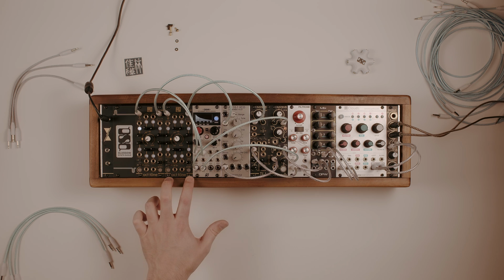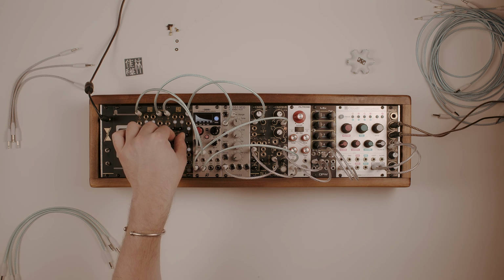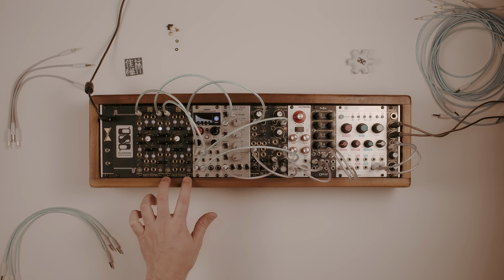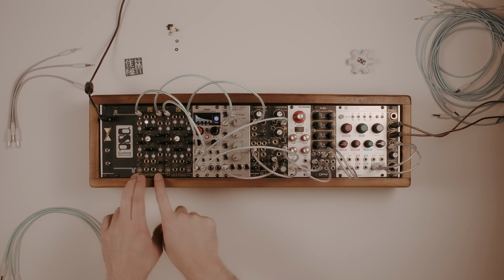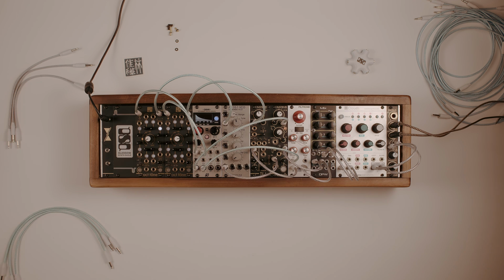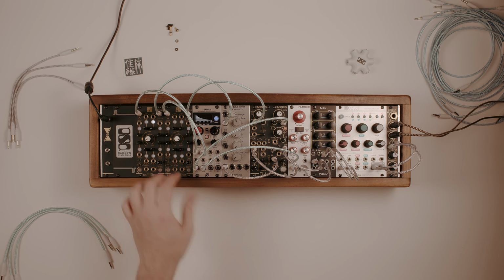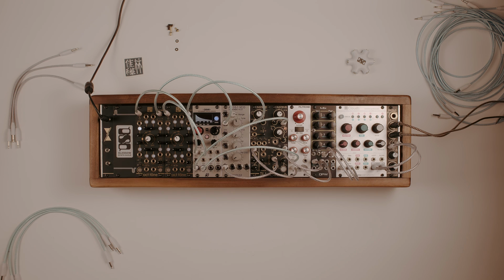So what happens here is the right side Octone still has its own internal clock, which is defined by its own rate control. And this gets applied to its clock step repeat functionality. If I slow the rate all the way down, it's basically hard syncing. So if we imagine this clock as a ramp, this is a slower ramp that's being hard synced in time with the main clock rate, which means I can actually get forced counts, so essentially multiplications inside this slower tempo. And if I speed it up faster, we can hear it doesn't become a static, sustained clock rate. It's actually becoming a burst. So yeah, the right Octone is essentially a burst generator. It's a little bit weird. It's kind of like a compounded use case of the defined parameters.